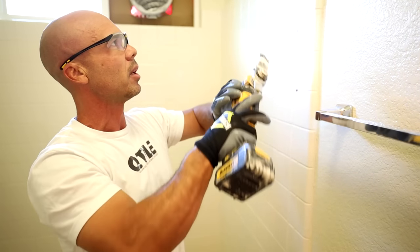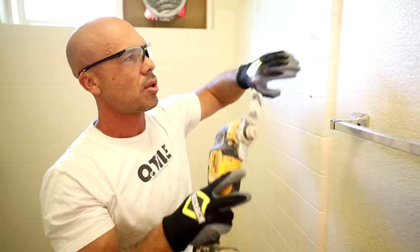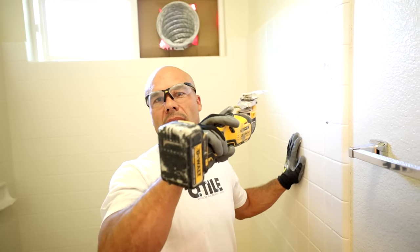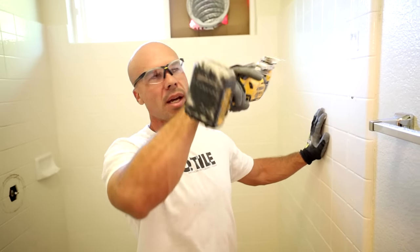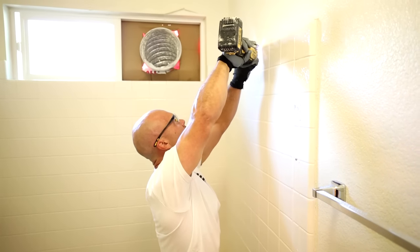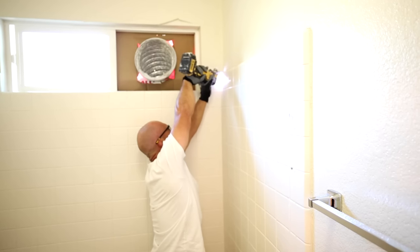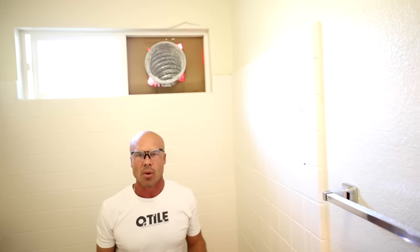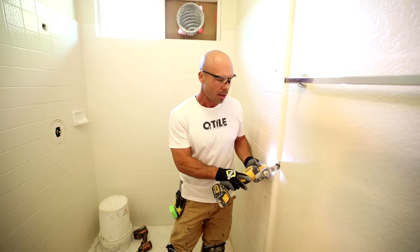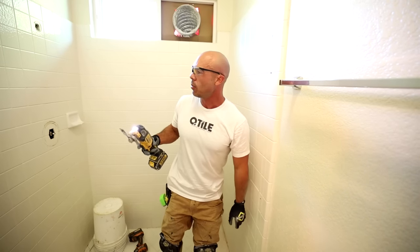Go in at an angle and you'll do just fine. Just try to get through that half inch drywall - don't waste time. If you hit a stud, you don't want to be trying to cut through it. You also want to be careful because sometimes there's electrical or plumbing. It shouldn't be real close to the drywall, but I've cut through water lines with sawzalls. So just be mindful to stay about a half inch depth when using these.